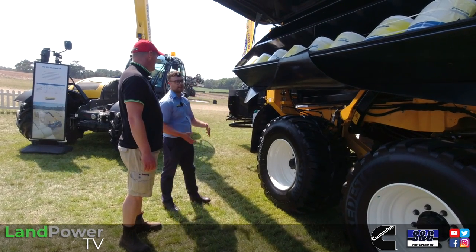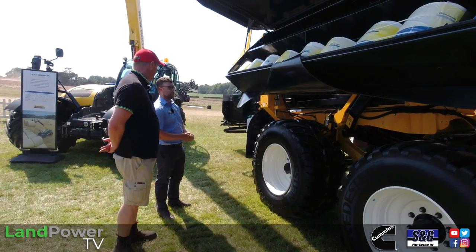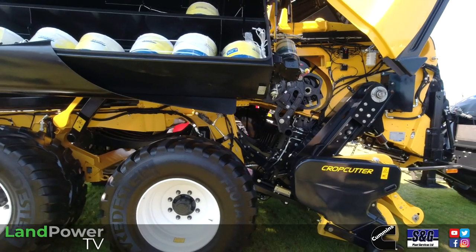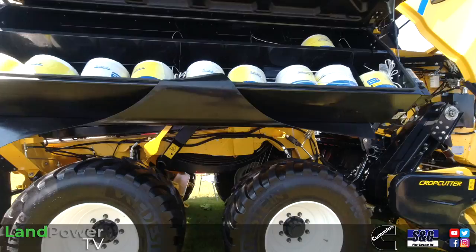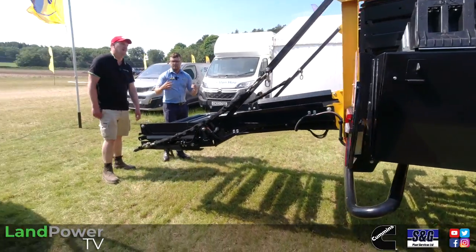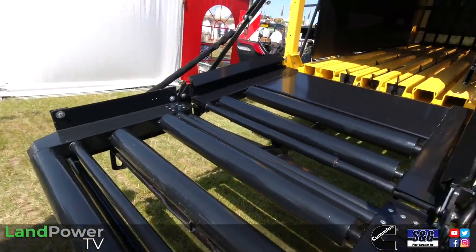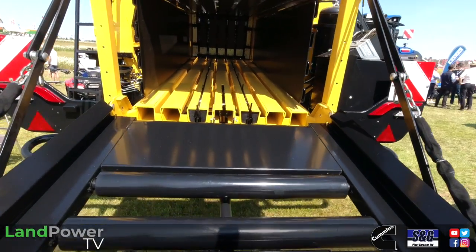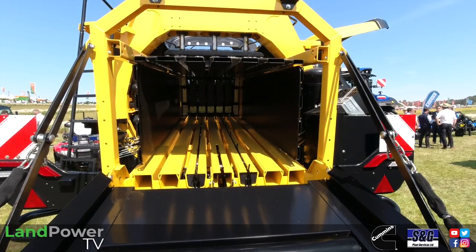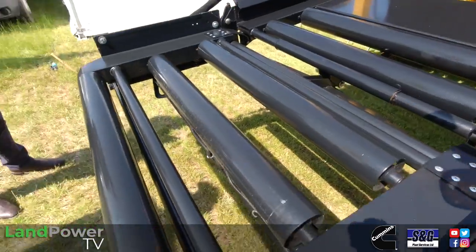Come round to the rear and you'll see the density ring: seven double-acting cylinders applying force and pressure onto the bale — two either side at the top — pressing on that chamber. That's where we get the density from, packing that weight in for the biomass market. The magic number we hear is 550kg as an average target bale weight.